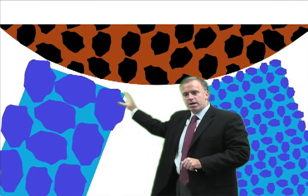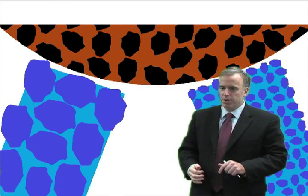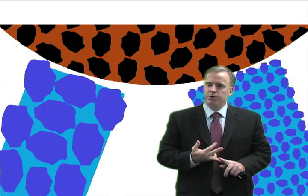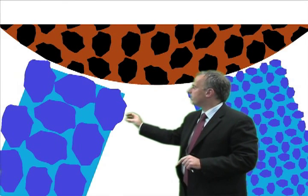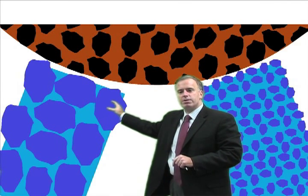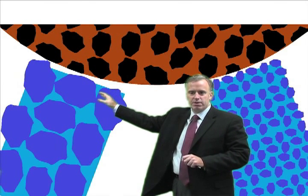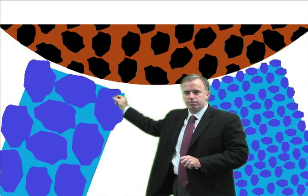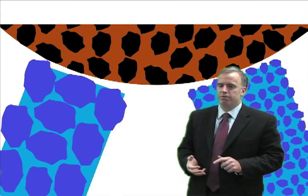Now, a typical mistake is people stick the wheel, but the grits in their stick are larger than the grits in the grinding wheel. So therefore, it's very difficult for those aluminum oxide or silicon carbide grits to get between the diamond or the CBN grits and remove that bond material. So we get very poor sticking or very poor grit protrusion.